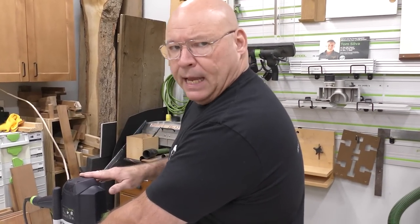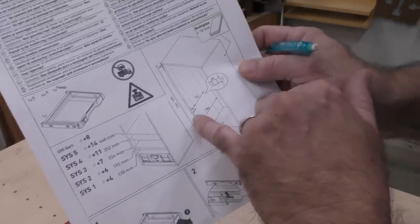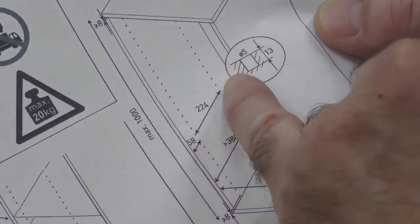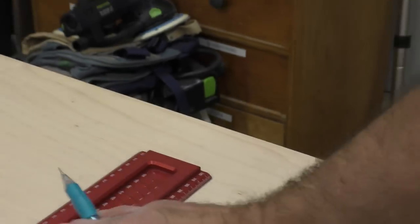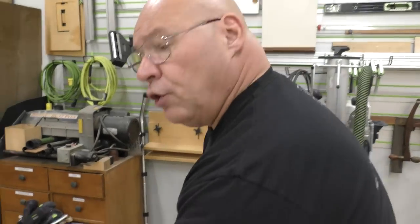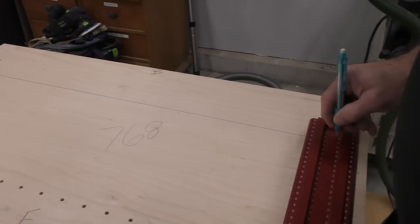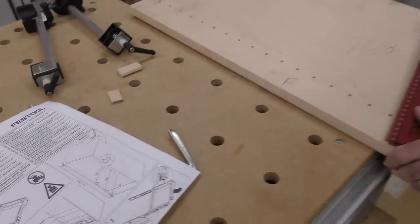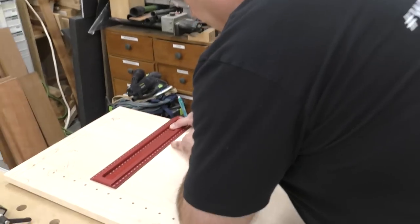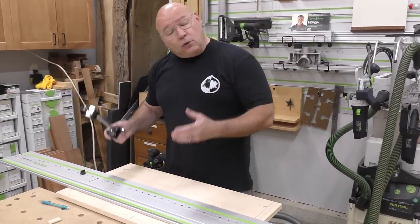As I'm ramping down, my hand has never left that portion. Now let's do some layout. We did the 58 millimeters from the front. But from the center of that first hole at 58 millimeters, there has to be a distance for the slide of 224 millimeters. So 224 plus 58 is 282. I'll show you how I always check it — I come here, do some quick layout at 282, bring it down here, and that'll help me lay out my rail. If I cut this at 400 millimeters, that means at 282 millimeters, that's 118 from the back — and you'll see it's 118 right there.